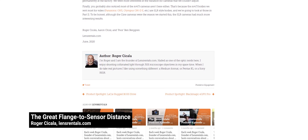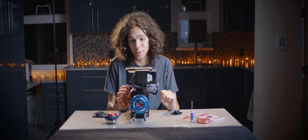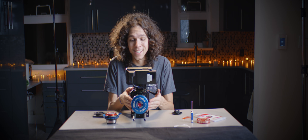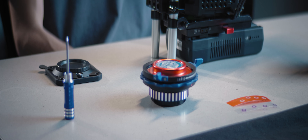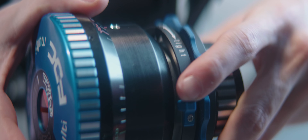There's a great article on Lens Rentals by Roger Cicala stating that if your flange is off by 0.01 to 0.02mm, you're okay — so this is probably it. But first, we also need to do the MFT mount. The DENS has a multitude of adapters so you can check the flange on almost any camera. Here we have the PL to MFT adapter.